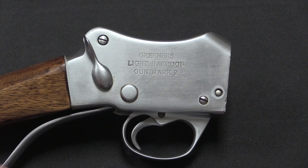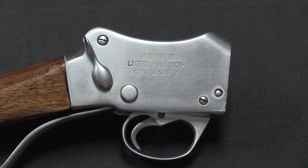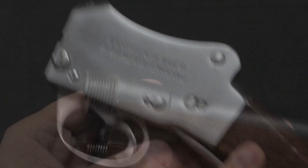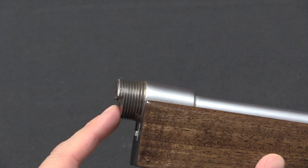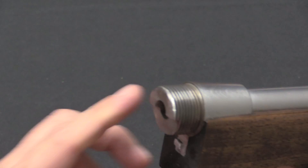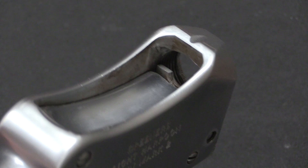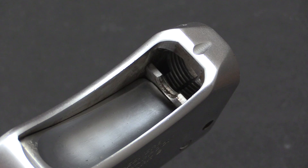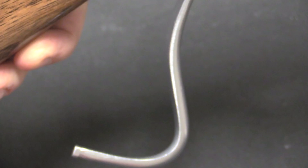Going ahead to assemble this — it is marked 'Greener Light Harpoon Gun Mark II.' I mentioned the safety automatically engages; I was mistaken on that. The Greener police gun does, but on the harpoon gun it's just a manual safety — turns on when you turn it on, turns off when you turn it off. We also have a marking on the other side: 'Greener in Birmingham.' The end of the barrel is threaded, and there's a step cut to make space for the extractor, which on the Martini action is a half-moon shape taking up the entire bottom half of the chamber. When you get to the last two revolutions of threading, you have to open the action all the way so the extractor is pulled back, in order to make enough space to finish threading the barrel on.